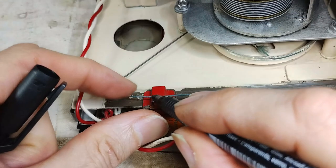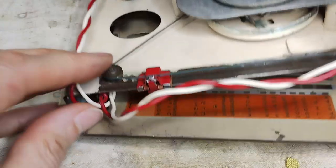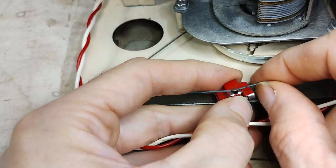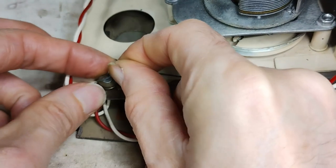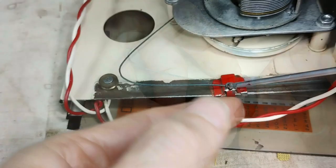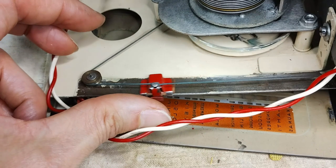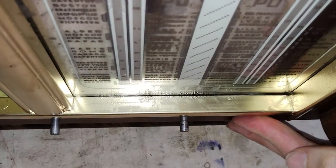When the dial glass was already installed, it was possible to notice that the second cord, the one responsible for the indicator movement, was too loose, resulting in a dial pointer that was hanging down. To put some tension to that cord without removing the variable capacitor that was already installed at that point, a simple trick has been used. Later, when the chassis was inserted again in the restored cabinet, the dial was fitting perfectly.